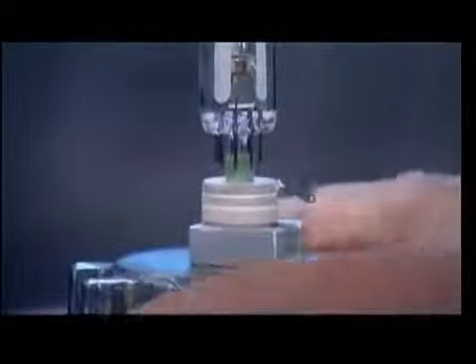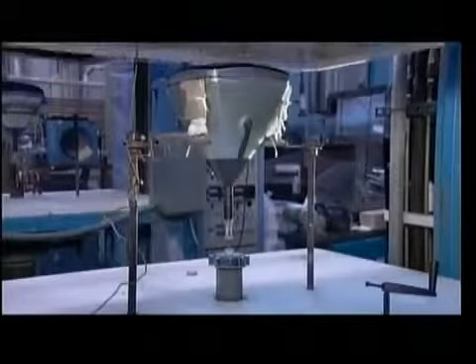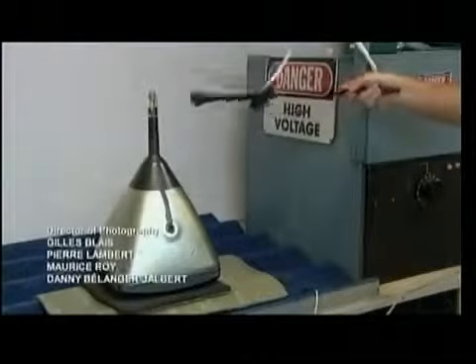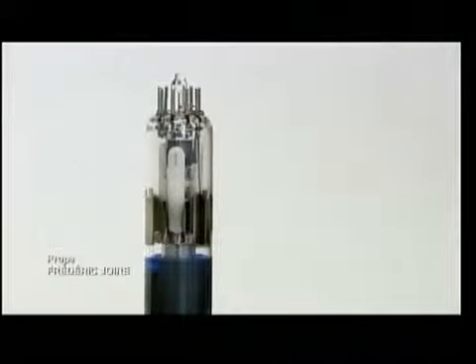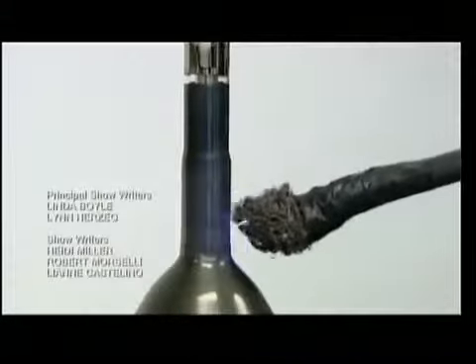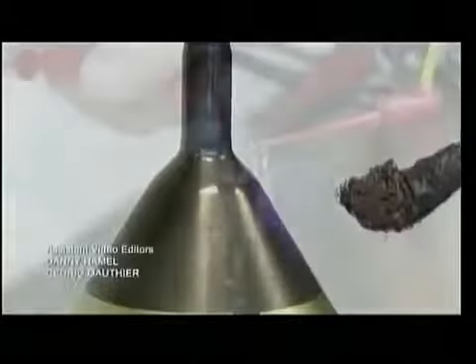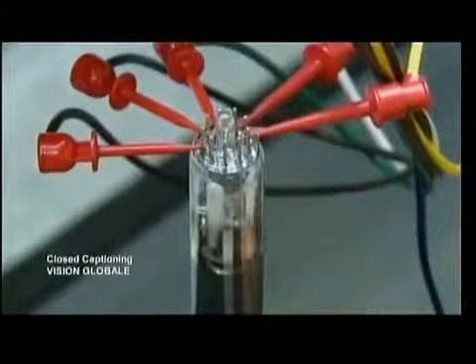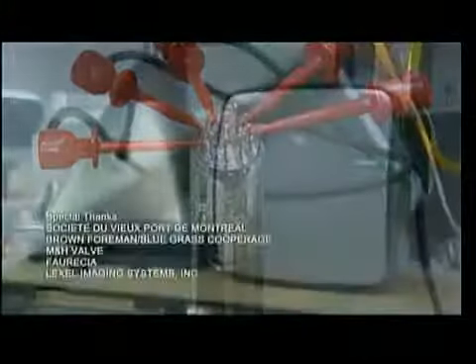This ceramic heating coil melts a green glass pellet to keep the bulb under vacuum. The tube is heated to 750 degrees Fahrenheit for two hours and, once again, a vacuum is drawn. To minimize image flicker over the tube's lifespan, workers condition the bulb using a high-voltage coil, which smooths any rough surfaces remaining on the electron gun. Finally, workers apply electrical connections to the electron gun to bring the cathode ray tube to life.